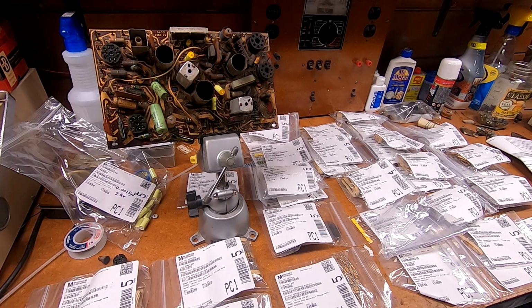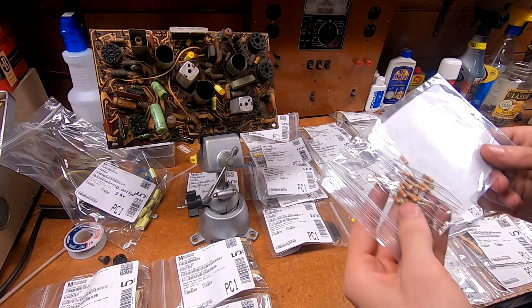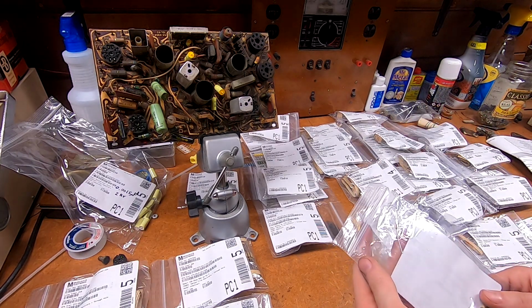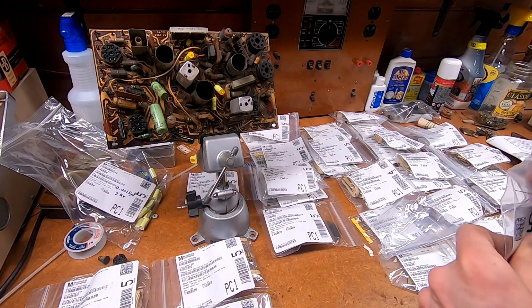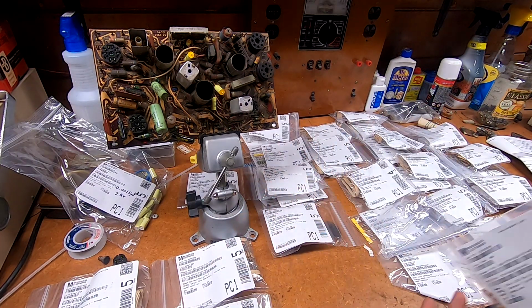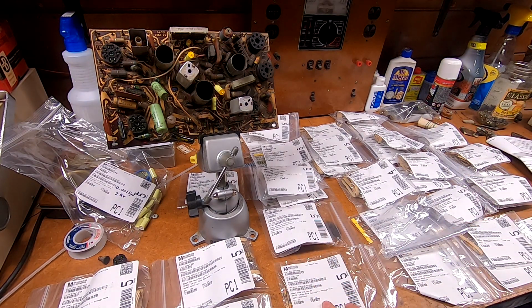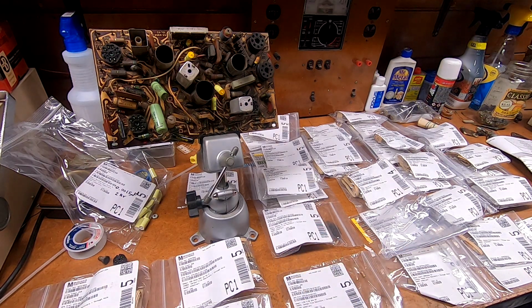So I went through Mouser, and I tried to get carbon film resistors if I could. There's practically no variety on Mouser for carbon composition resistors anymore. They're just ceasing to make them. So there's no way to put these things back 100% factory because A, they don't make paper caps anymore, and B, the carbon comp resistors in there are drying up. They are being phased out. I think Allen Bradley was one of the few companies that was still making them. Or maybe that was Vishay or Sprague or someone.